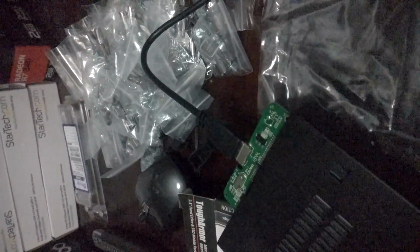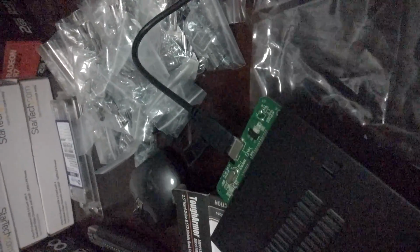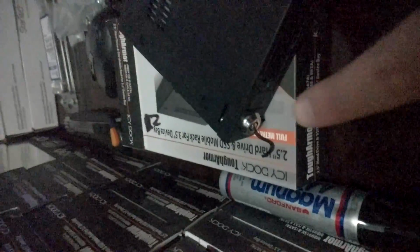On top of the hot swap, I was also looking to make sure I could get hard drive activity lights. So there's power lights that'll blink orange for data activity. And of course, on the back of it, the I/O lights, if I go ahead and access this drive, in a second here. Yeah. So we have our I/O activity lights in the back here, which this manufacturer's gone with blue, which I don't hate. And then you'll have your actual hard drive activity lights up front, which the controller's intercepting in the back here. What's great about these Icy Dock drives is that they are just direct connect. So there's no vendor funny business.